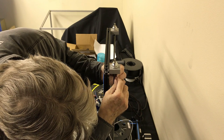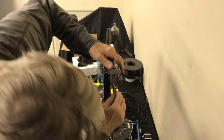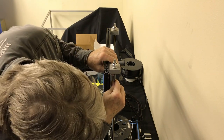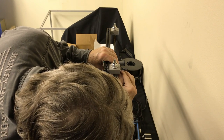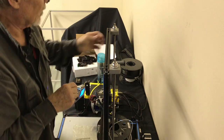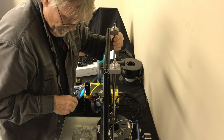We want it to be up against it, but we don't have to have it real tight against it. So, boy, that was it right there. We had a little too much tension in here, and if you push up and down on this rod, and if there's any play in it, you'll hear it and see it. But this is about perfect. It's not binding anymore though, so that's a real important part of this, what we call tuning it. So we got that tuned. This one here is real nice. I'm doing the up and down, no problems on this guy.